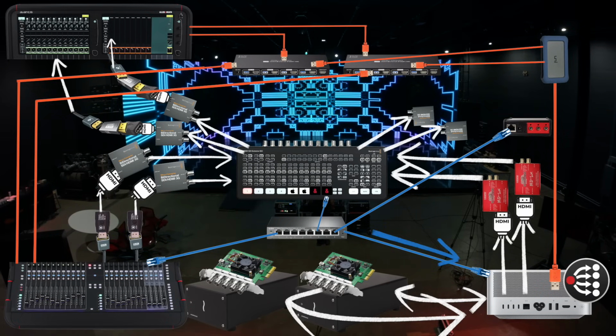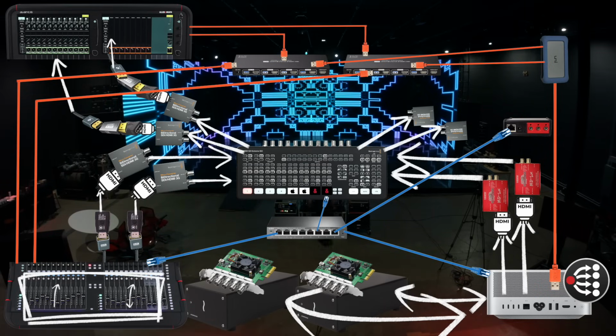Companion sees that MIDI command has been sent and triggers a couple of actions based on that command. It tells the ATEM which video source to send out of outputs 3 and 4, the Avantis monitors, and tells the IP to IR converter to switch the 2 KVMs to their respective USB sources. Finally, it sends the last command back to the Avantis console via MIDI to change which scene it should be on. These scenes change the physical fader assignments on layer F.